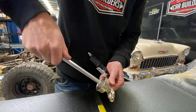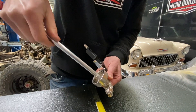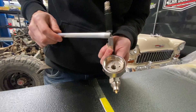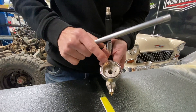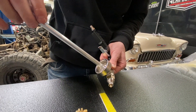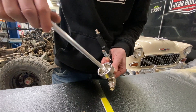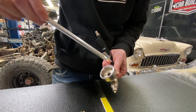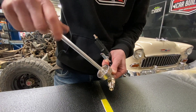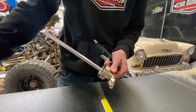The pickup tube on this you can screw out. What you need to be mindful of is this is an aluminium pickup tube — it's got a fine thread on it. This is steel, it's got a steel thread, and steel is stronger than aluminium. When you put this in, be careful that you don't cross thread it. If you've got paint gummed up in here because you haven't cleaned it out and you're trying to screw this in, you're going to damage this. Make sure that's clean. Screw this back in — a good idea is screw it in when it's wet, clean it out properly, then you're good to go for next time.